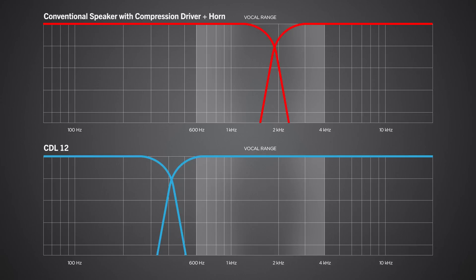As a benefit, a lot of you have been out there trying to get the vocals up above something. This will allow you to get vocals up above and gain before feedback to where a single horn wouldn't. So you end up with this nice, smooth, symmetrical pattern, and you get a lot of SPL out of the middle. The tonality, having those cone drivers, is really nice and actually less fatiguing than a compression driver.